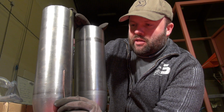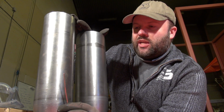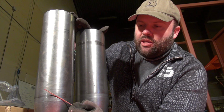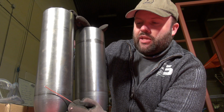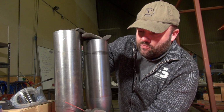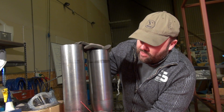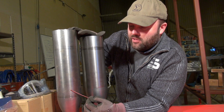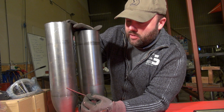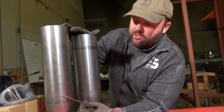Now, the headache is that we have been trying to figure out how to attach this kind of spacer to the inner liner or the outer liner without causing warping from the heating itself. Our first line of solving this is trying to solder this spacer to the liner itself. When doing the soldering, we risk local warpage because of the heating.